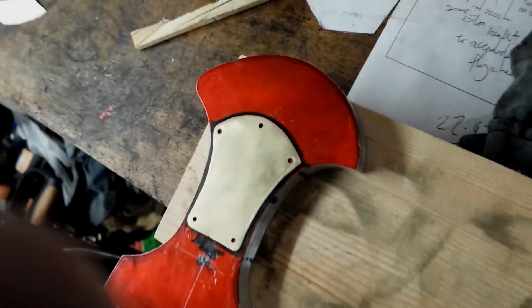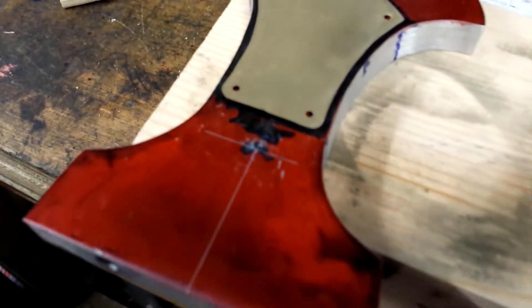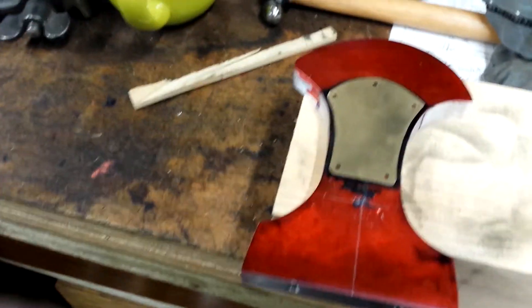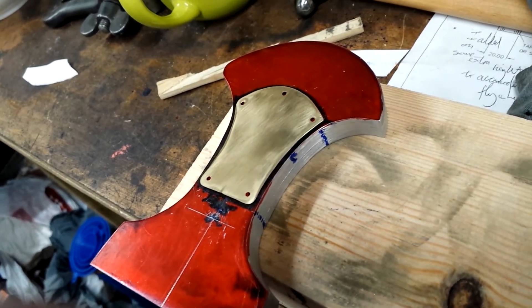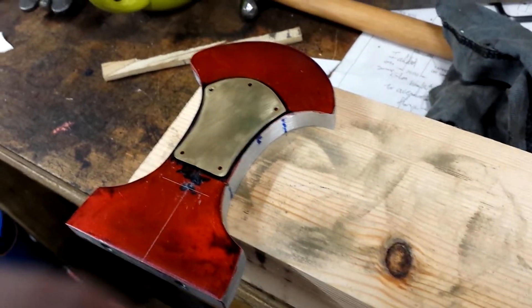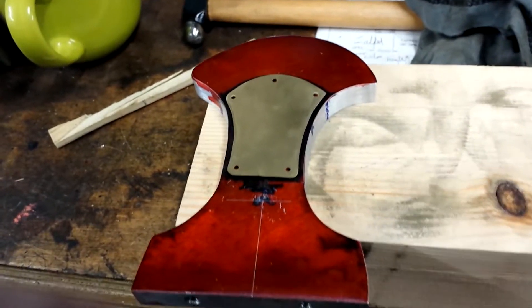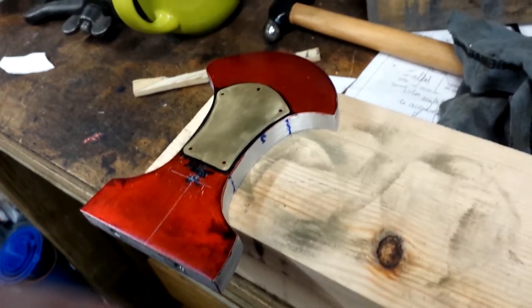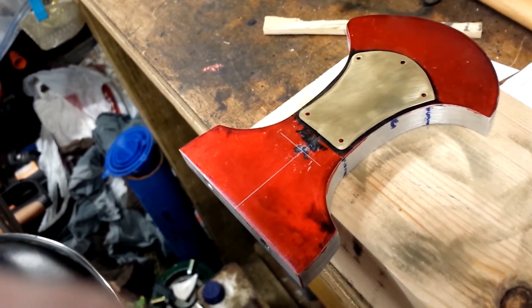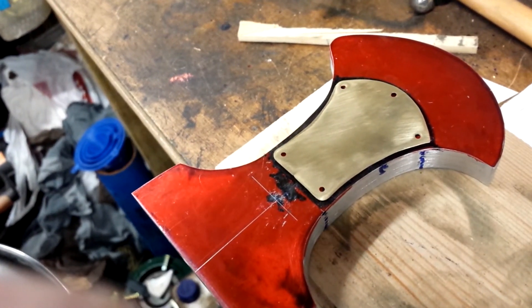I've put quite a bit of work into this and I think that surface is flat in the important places — we'll see when we try it. There's a bit at the bottom which bore a bit thin with the sanding and it's almost threatening to split, so I'm giving it no more. This is now going to be fixed to the body of the engine with JB Weld. The reason I'm using JB Weld rather than ordinary epoxy is because it has a much higher temperature resistance — several hundred degrees centigrade — whereas ordinary epoxy starts to soften below the temperature of steam. When it's pressed on flat with JB Weld and clamped, it should be absolutely flat against the body of the engine. That thin bit at the bottom, which is away from where the cylinder will oscillate, fingers crossed, will be insignificant.